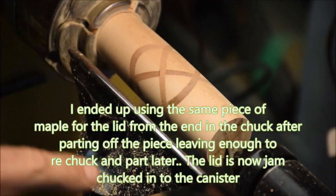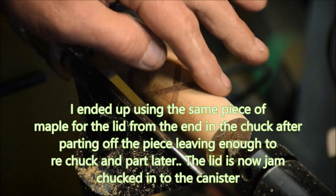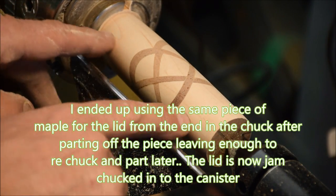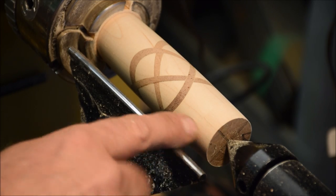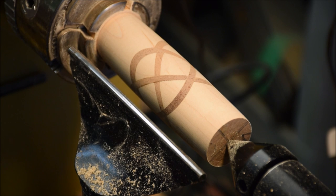I'm coming up with a pretty nice looking shape here. It's extremely thin — maybe even a little too thin, but I don't think so. It's probably down to about a little less than an eighth of an inch out here and about an eighth of an inch here in the middle. I've done sort of a slight curve to this piece. Now I'm going to be finishing off the top, sanding it down to 320, and putting some finish on. Then I'll share the finished image with you.